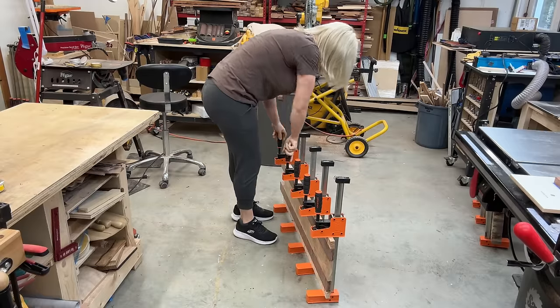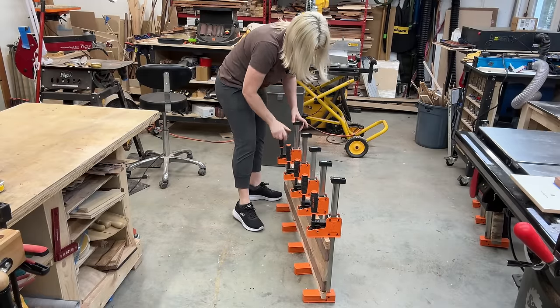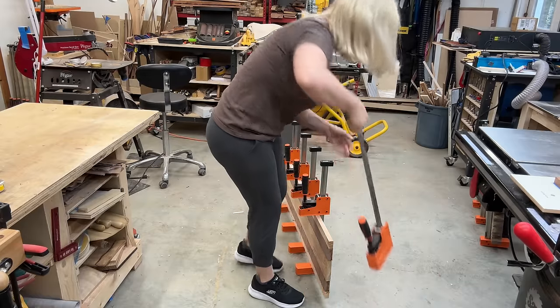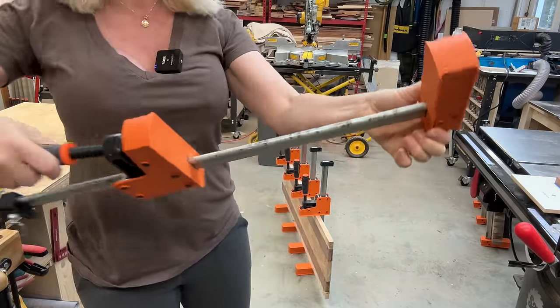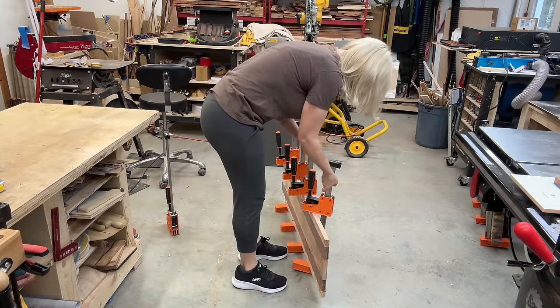Good morning you guys — it's the next morning. I'll be letting this dry until tomorrow, and then we'll come back to plane them and cut them again so we can really see the pattern. Now we need to take the boards out of the clamps and send them through the planer. I forgot to put paste wax on this set of clamps, but there was probably still a little remnant from before — and you can see there's really no glue on the clamps. That trick seems to work every time.